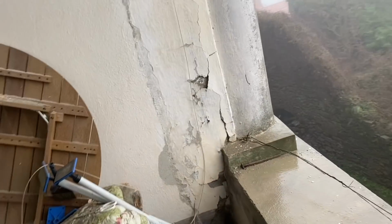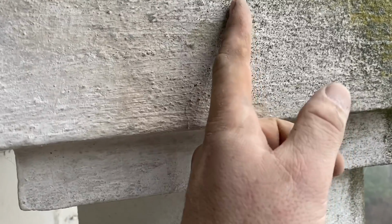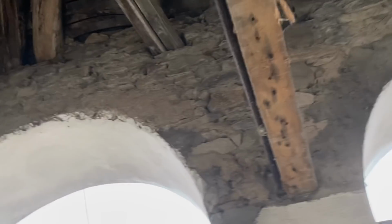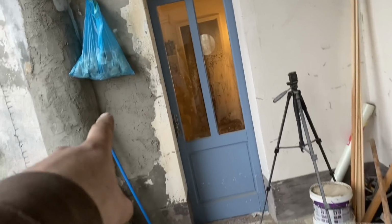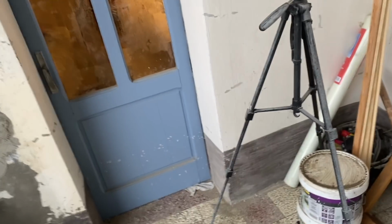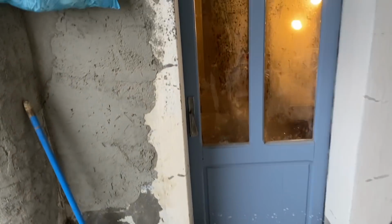Now, I want to keep the wiring accessible. It is undercover-ish here, so I thought, as I'm going to be here on the side, climb up, I would drill into this upwards, and then have the cable basically go around here, and there they go up, and they'll meet at little junction boxes up on the wall here, and I'll run a wire pipe basically across the top. We'll have a light switch over here somewhere, I would have thought, so that if you come in through the little gate or out of this door, you can turn it directly on. And if not, you'll have to basically take those 3 steps.